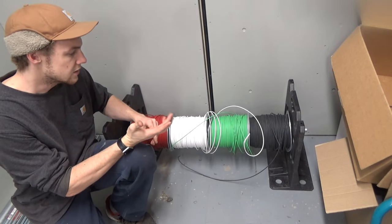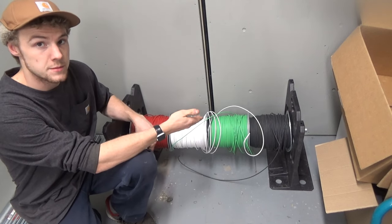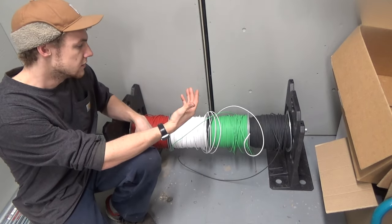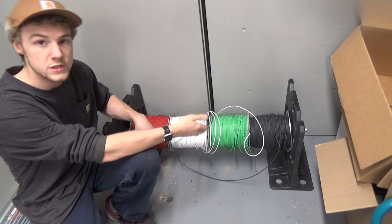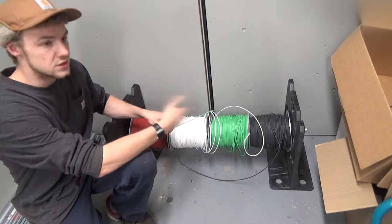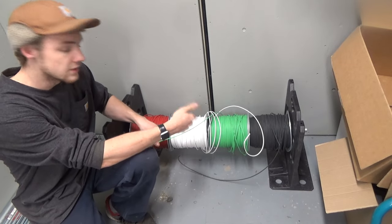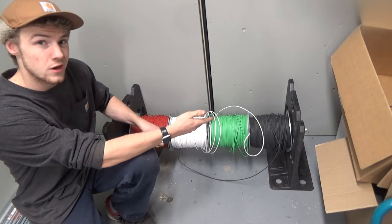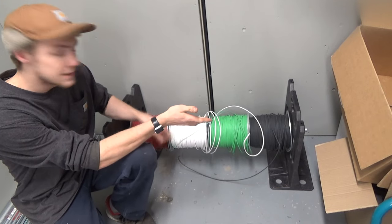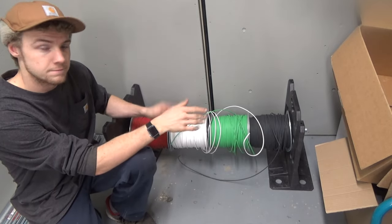Generally in Canada, we could downsize our bond or negate it completely because we're running metal conduit. However, in some spec, you always pull a bond, and by chance where I purchased it, I got a pretty good deal in the same size. So we're still pulling number 12 bond, even though it could be 14 or forgotten about completely, but we're doing it anyways. Little overkill. Fair enough, right?